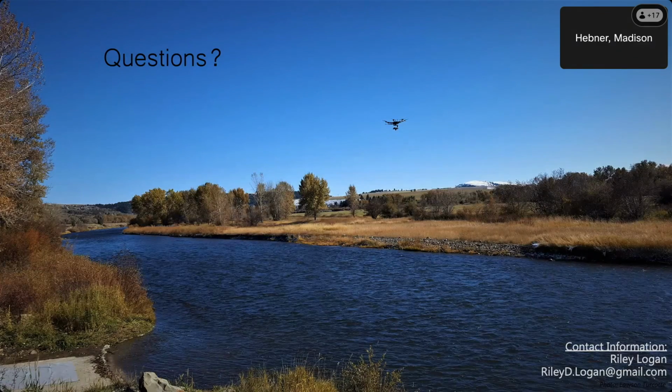Yeah, if you know what wavelengths you want, then it's easy to design this. We have basically just a monochrome imager that's sensitive across a large wavelength band, so 400 to 1,000 nanometers, the same region we have. And then we isolate the bands that we want with filters. And so if you know the wavelengths that you want, you could just buy new filters and basically be ready to go if you need 4 bands. Does that answer the question?